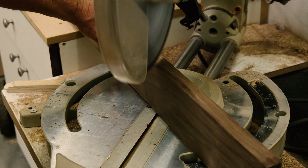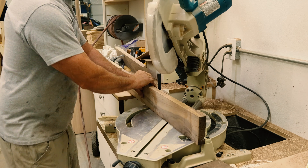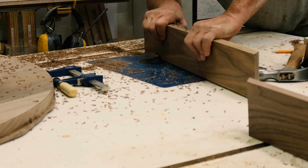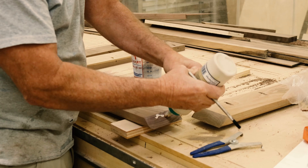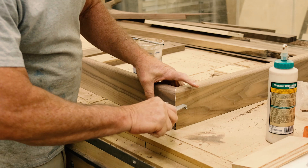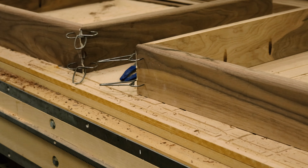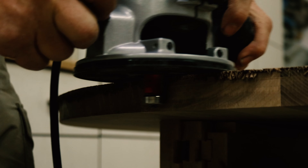This is my skirt board. I'm going to go ahead and do some 45-degree miter joinery on it, maintain the grain where the leaf would split, and did a little round-over. Not convinced of this joinery to put the skirt to the bottom of the table — I'm going to have to come up with something different. While the skirt sits and dries, we're going to go ahead and flush trim the top.